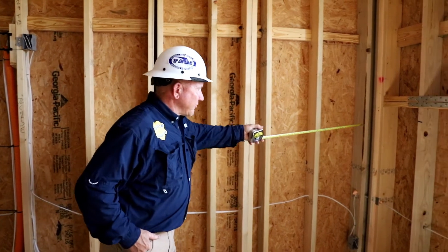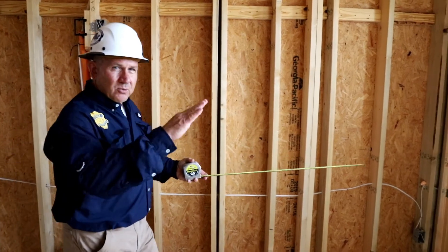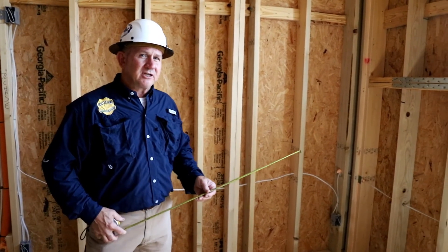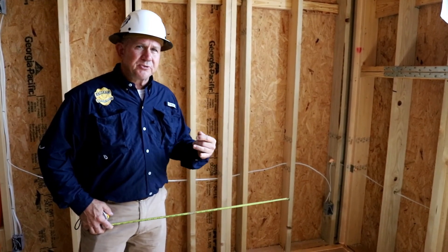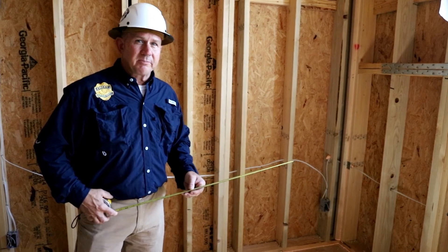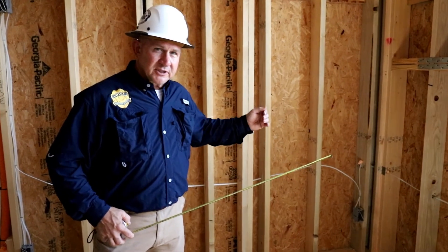Typically this first four feet, sometimes eight feet, is going to be the lateral bracing. So it's critical that all this sheathing be nailed off properly. That's one of the things that's really sometimes difficult to look at if the Tyvek is already up. If the house wrap is on, make sure that you disclaim that you were not able to verify that. If you can see it, you want to verify that it meets what's required by the construction drawings. Either way, you need to disclaim it and exclude it from your report if you can't see it, or if you can, make sure that it's done right.